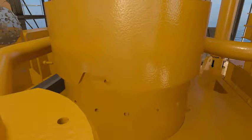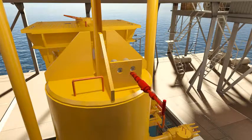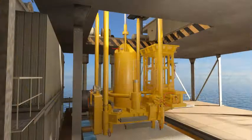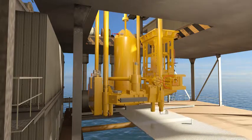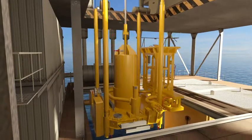The running tool will rise in position to fully lock the tool. At this point, the hot stab should be plugged and the pump removed. A final visual check of the flow base and running tool should be carried out to ensure all caps are in place and there is no damage or obstructions. The equipment can now be run subsea through the moon pool using tug wires on the drill pipe where necessary.